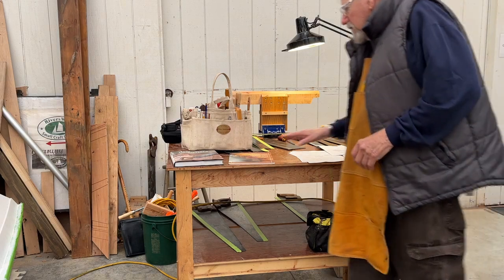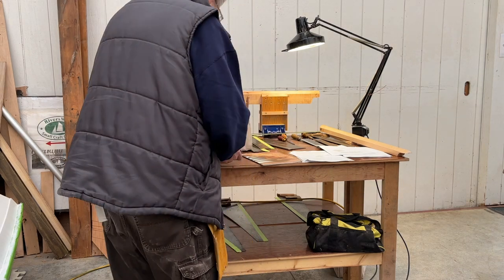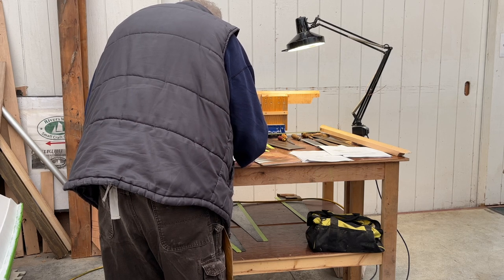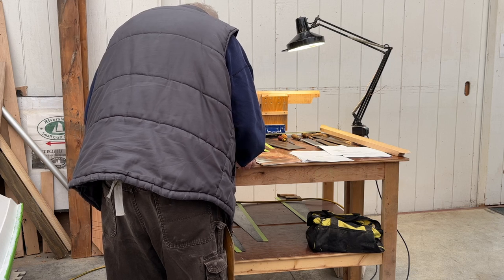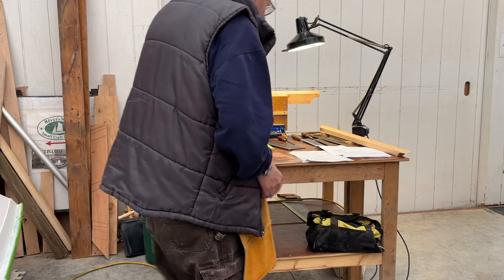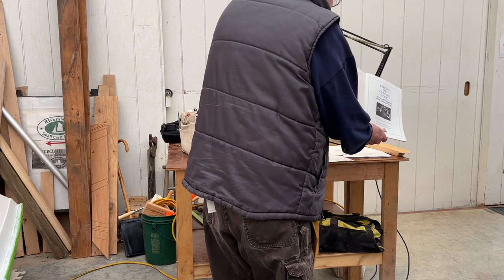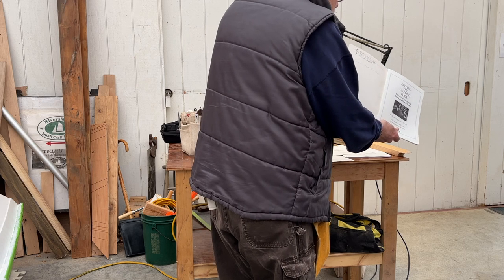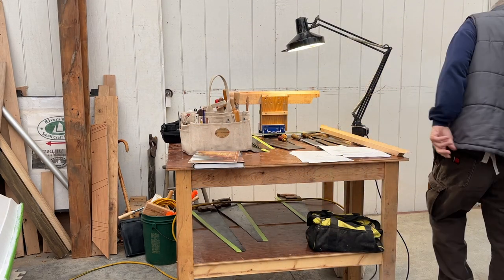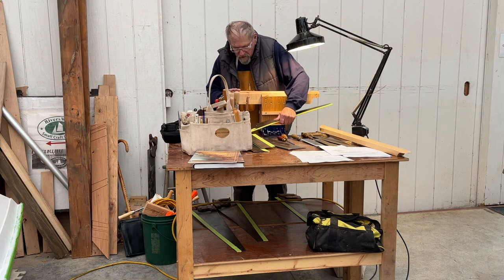You should take a look at this book — it's Christopher Schwarz's, all about hand saws. From Sellers, the file sizes you need are: seven-inch taper, seven-inch extra taper, seven-inch slim taper, and maybe a seven-inch extra slim taper — those are for ten-point saws. I like to use six-inch a lot. When you get down to really fine teeth, filing is a real pain.